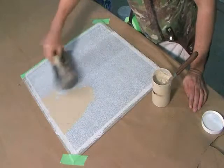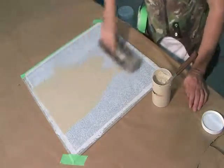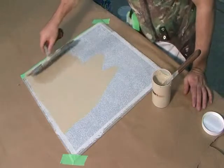Begin by priming the surface with our Versi Lime Quartz Primer. Sand the primer when it has fully dried. This will reduce the amount of plaster necessary to cover the orange peel effect created by the primer.